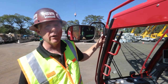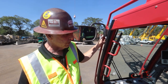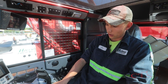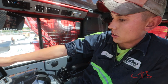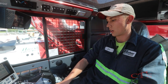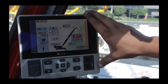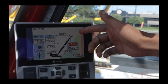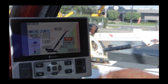We're sitting in the cab of this MLC-150. It's pretty standard layout, very similar to a lot of the MLC series. The most basic thing that's the same in all of these cranes is going to be our two computer screens. This is your CCS control system, which is now the same in all of the Manitowoc product lines, excluding the tower cranes and boom trucks. Our upper screen is going to be all of your LMI stuff, your rated capacity - it shows everything going on with the crane: your counterweight, boom angle, radius, load chart, line pull, parts of line, what you're capable of picking up, what you have on the load, and your tare.